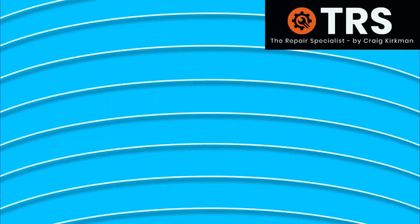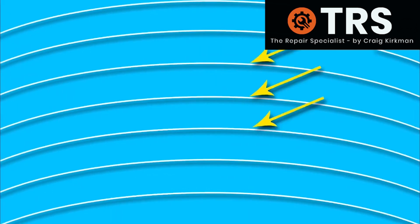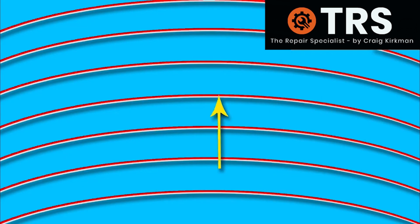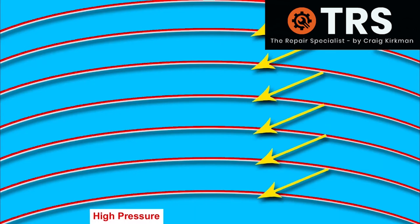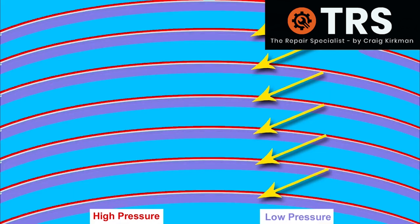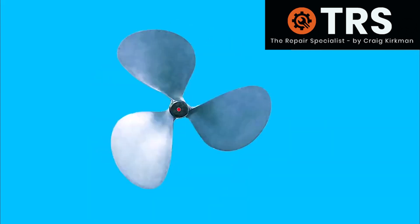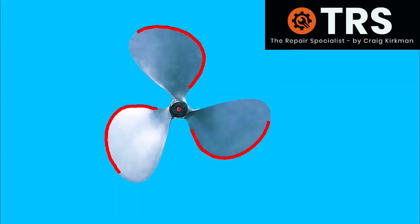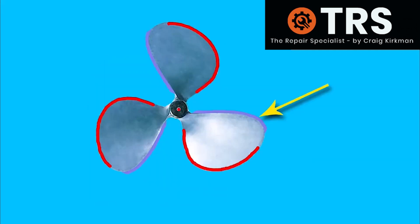If we could see inside this tank to observe these waves, we would see them moving out through the fluid away from the transducer. Each wave experiences high pressure on one side as it moves up through the fluid at ultrasonic speed, and this causes behind it a pocket of low pressure. Although not moving at ultrasonic speed, a boat propeller experiences these same two types of pressures — the leading edge is under high pressure as it cuts through the water, and this movement causes low pressure on the trailing edge.